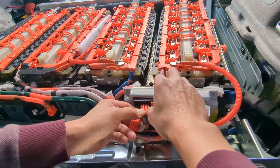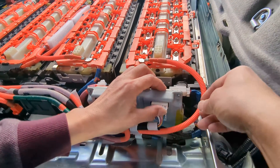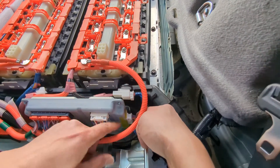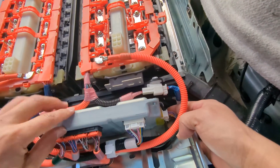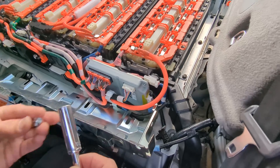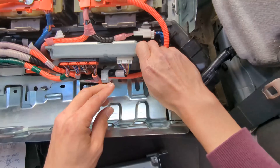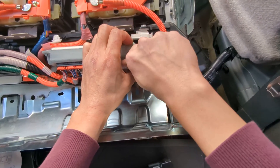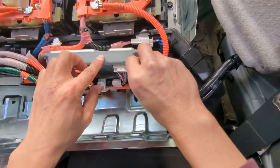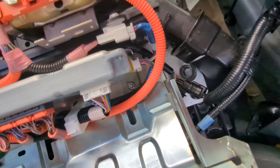And then last, connect the most positive. After that, connect the rest of the sensors — temperature sensor, temperature sensor — and then the 12 volt at the end, at the bottom. This is the proper way. Also, don't forget to connect the bolts, because sometimes, especially in the older design, the bolt is used as a grounding. So just play safe — put at least one bolt so that it's grounded. The case is grounded so there will be no arcing or anything that can destroy the IC.